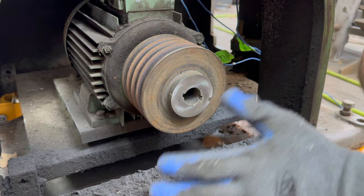Adding acetone to paint stripper did two things. It seemed to stay on the surface a bit longer, and it really stripped things very well. The paint stripper doesn't really touch this stuff, the body filler, this kind of gray black stuff, but the acetone makes this sticky. So the acetone will kind of solve this. Putting the two together takes everything down to the primer, which is this red stuff. And that's fine. The extra thick spots of the body filler wipe off. This will dry and I can sand that and it should be nice and smooth.